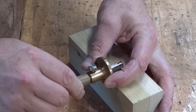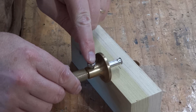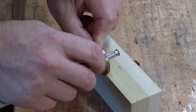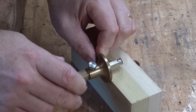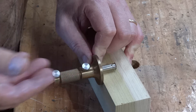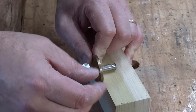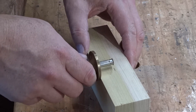What I'm going to do is take my marking gauge. I have two adjustments on this particular one — this one locks it so I can do fine adjustment, and this locks the whole thing when I'm done with the fine adjustment. With both of them open I can get roughly to that mark and then lock this one. If you have one with just one knob you can do the same thing — just loosen it slightly or tap it on the end to get it to move.